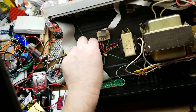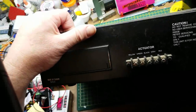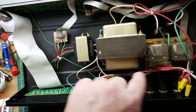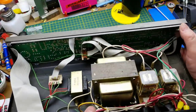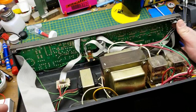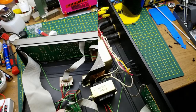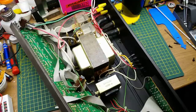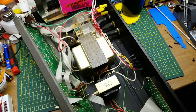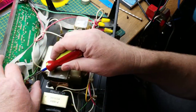There's another wire that goes from the outside terminal. The three on that side labeled black, gray, and red are the potentiometer, and the yellow and green are the ones that drive the motor — those two are the wires coming from the relay board. So there's no real processing going on in the driving; the memory is all completely analog. Let's see if I can get this front panel off. It's got a couple of screws in the corners and a couple in the bottom. I'm not intending for this thing to go back together.